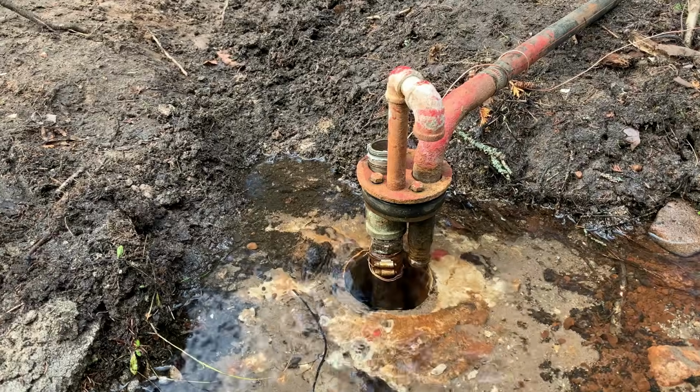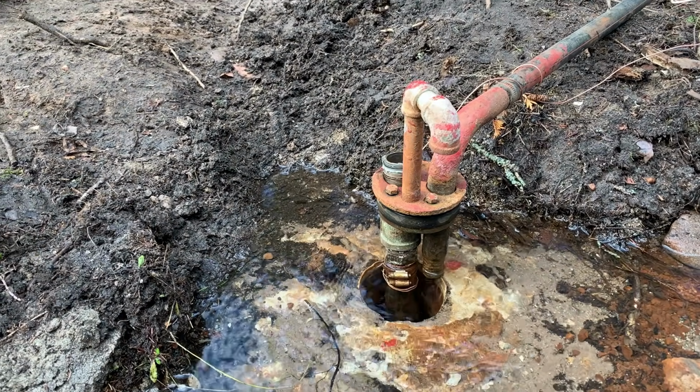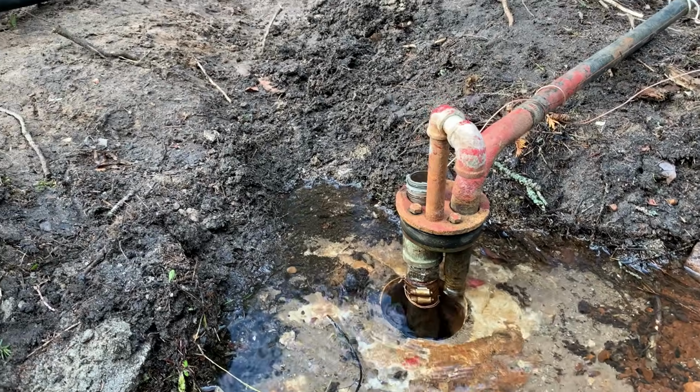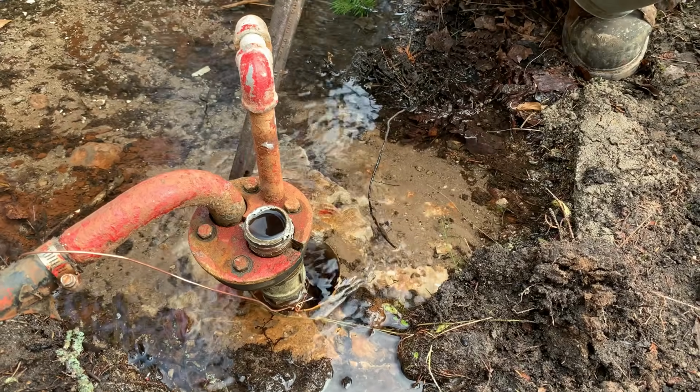If you were connecting to a lake or river, then you'd run the heating cable through your water line all the way to the point below the expected frost level. And if you're connecting to a regular well, the heating cable goes right up to the casing, but then stops.